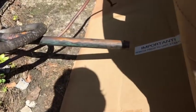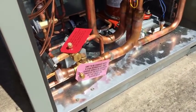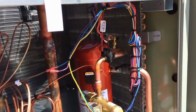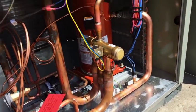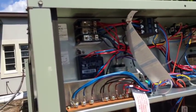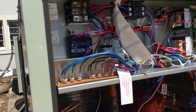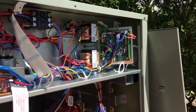My brother's about to blow out the lines, so I've got it all set up to block some of the stuff that comes out. There's our copper coming out of the reversing valve, a big compressor there with what looks like a motor controller for head pressure for low-ambient cooling. There are a couple of transformers, some double-pole double-throw relays, a contactor up there. Looks like a voltage monitor — that's a voltage monitor right there, which looks like an Ideal that's been rebadged. And the control board right there.